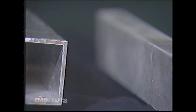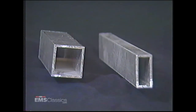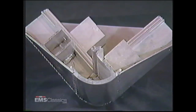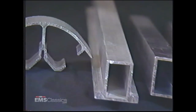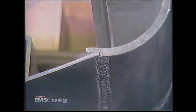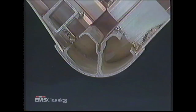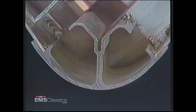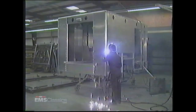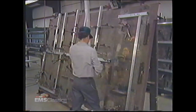Excellence units are solidly built. Structural members consist of 2x2 and 1x2-inch tubular aluminum extrusions. Walls are a full 1/8-inch thick. Aluminum corner posts are 1/4-inch thick on the Golden Eagle, and 1/8-inch thick corner posts are featured on the Silver Eagle. A stronger module allows more protection for patients and attendants. We begin construction with the aluminum members on the framing jigs.